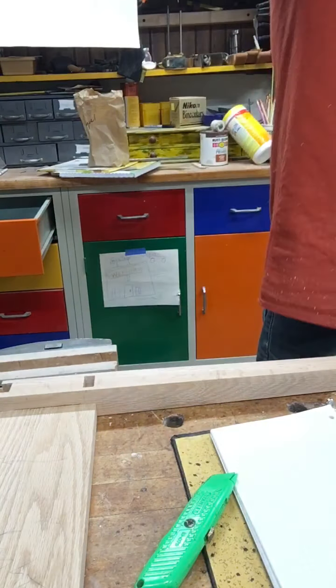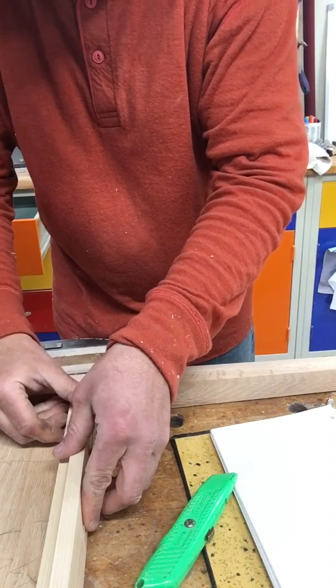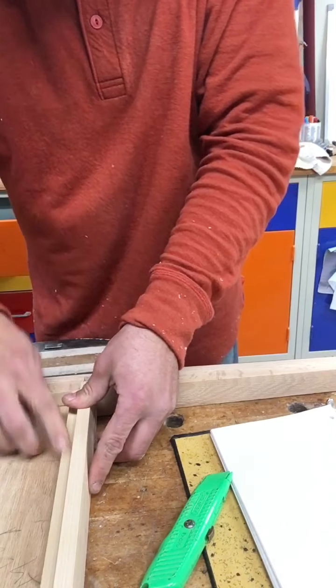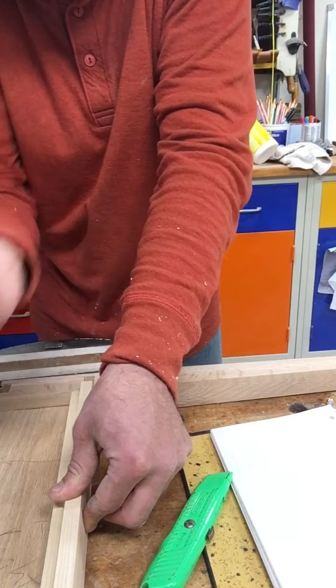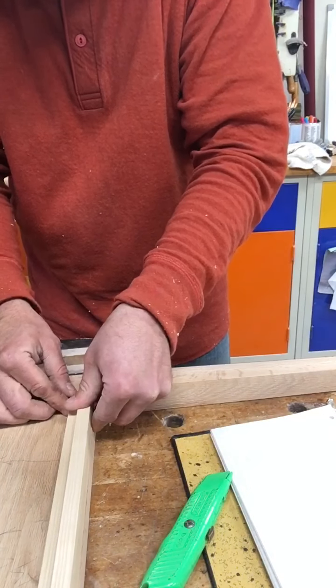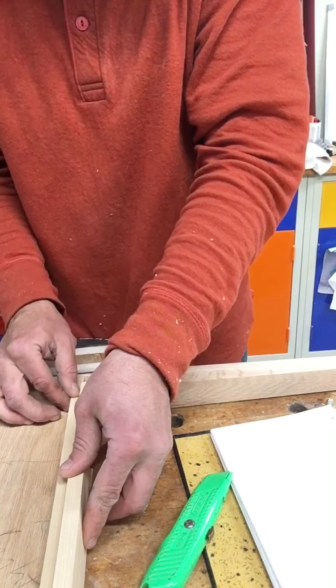Let's go see how they fit. Turn the vacuum off here. These pieces are going to go in with the half-inch part down below and the other part lining up evenly with this surface. It is a big deal if in the front there is a snag, because it's constantly going to be hitting your piece. So I'm happy with the way that feels there. Once I put this on, I'll go ahead and sand that a little bit to make sure it's easily done.